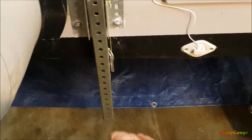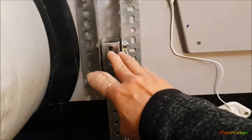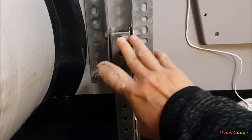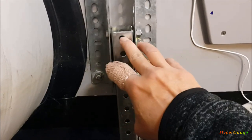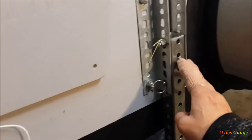The length that I use is 18 inches. The reason is they sell it in a 36-inch piece, so I simply cut it in half. Keep in mind though, because we're using the pre-drilled holes for mounting, the even length of the two legs actually depends on where you mount the holes. For example, if you cut it and miss one of the holes, you have to mount in a different hole — that means you only have 17 inches on one side. The length always depends on the transom of your boat. In this case, 18 inches works fine — I can flip it up and down with no problem and I have enough clearance.